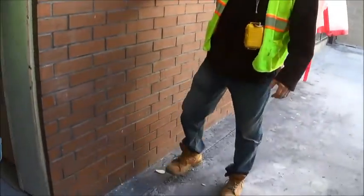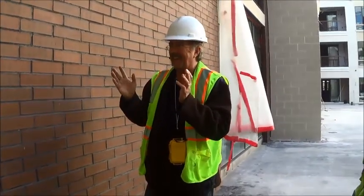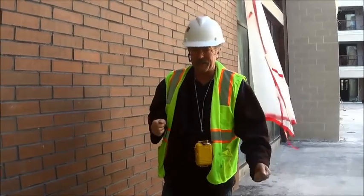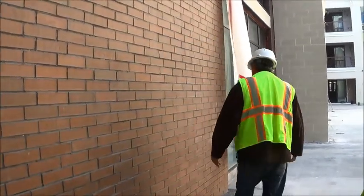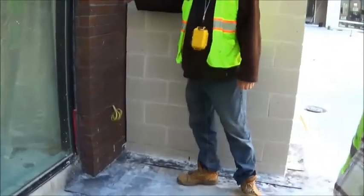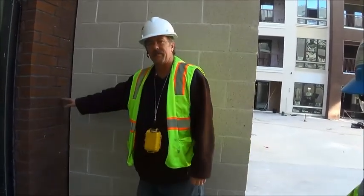Upturns on walls. A lot of times you're going to see drawings that show an upturn on a wall, and if you're not watching, you just think, hey, it's a standard detail, so 6 inches up the wall, the guys with the squeegees come along, hey, I've done it too. Not watching, come down here and check those weep holes. That wall was affixed here as an interior wall. Of course, they'd have to insulate it. The water rides up and travels into the building.